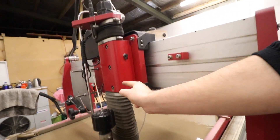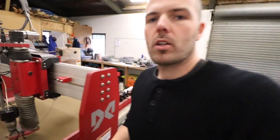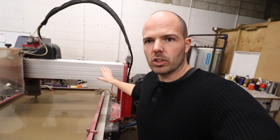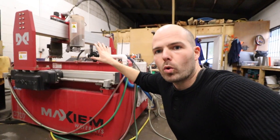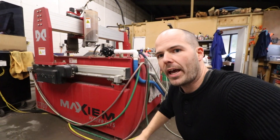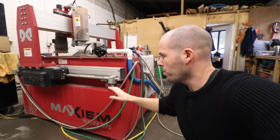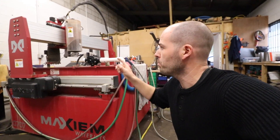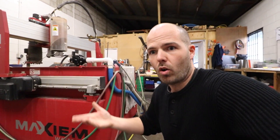Here we have the Z travel — so three dimensions. This is called the gantry. The whole gantry is resting on basically a huge tank of water. It's got to be a tank of water for at least two reasons. One reason: you've got to have this body of water to stop the force of the stream of water coming out.